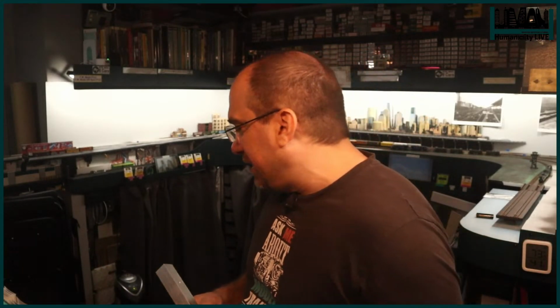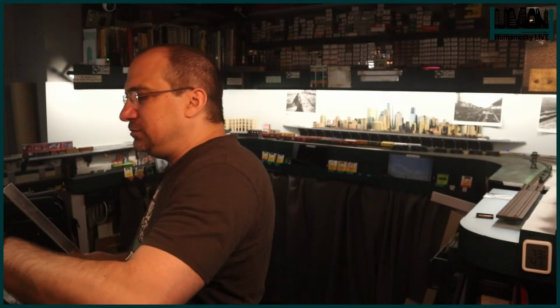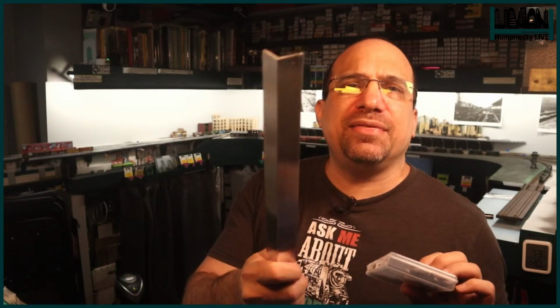So ideally, in a perfect world, I would change them all over to panhead screws, but it's very likely I'm just not going to do that. So I need to attach this piece of aluminum to all these pieces of wood, using these number 8 3/4" long screws, going from 1/8" metal into 3/4" plywood. So I got 3/4" screws, so theoretically the right length.